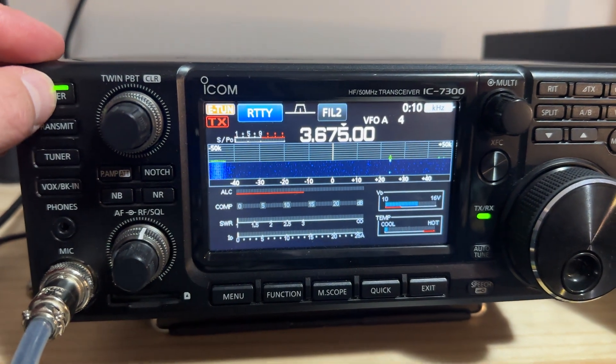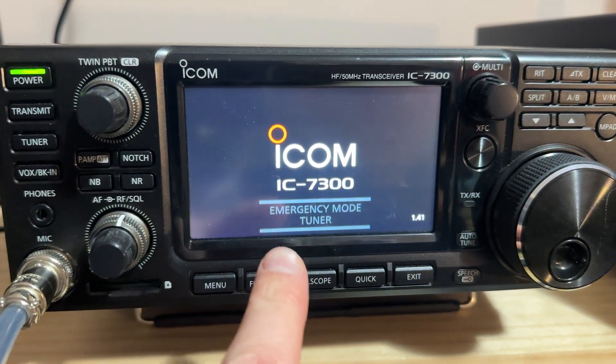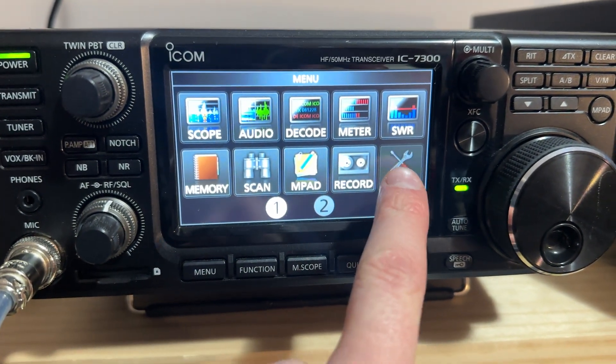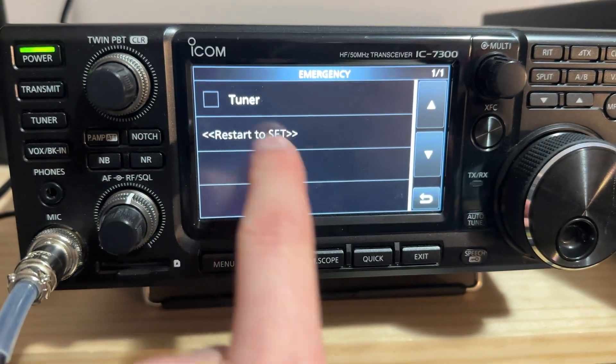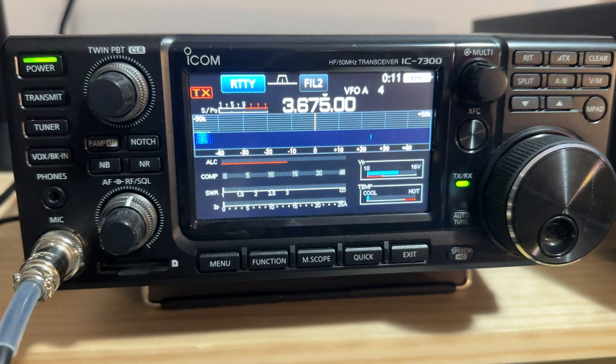You have to turn this off through the menus. If you power the radio off and then power the radio back on, it will come up in the emergency tuner mode. So just go back into the menus to turn off the emergency tuner mode when you're done with it. Restart the radio and you're good to go again in normal operation mode.